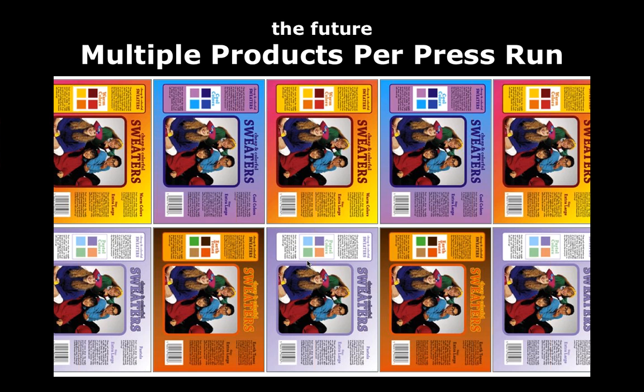So some of the numbers we have from a large wide web flexible packaging printer is the savings of $1 million per press per year. Those numbers seem so high that we're almost embarrassed to share them because it seems like we're trying to twist the truth. But it can easily be $1 million per press per year. If you have $1.6 million in startup costs throughout the whole year, that's all your downtime, all your ink waste, all your paper waste, all the costs associated with startup, pretty average cost for a large wide web press, and you can reduce the number of make-readies by 2/3, or in this case, by 3/4, you can easily get savings in the $1 million plus range per year.